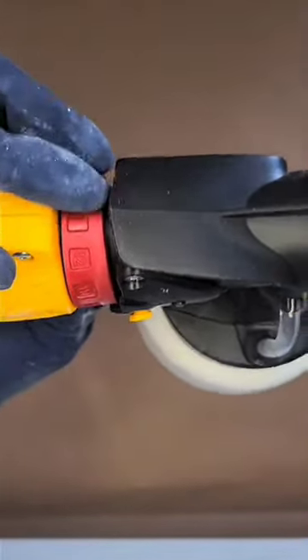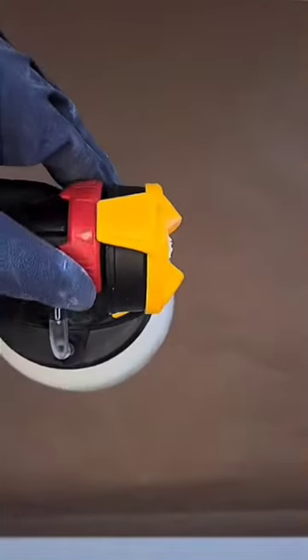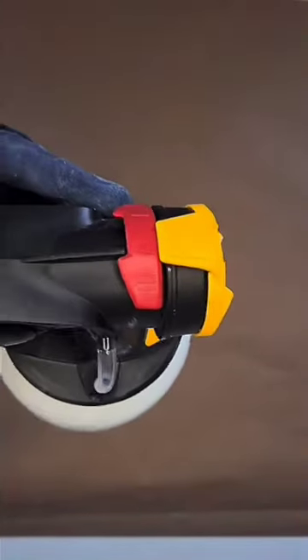Next, I'm going to attach the hose back to the gun, and I'm going to set the dial to 1. I'm also going to use a wide spray fan. Remember, I have the air turned all the way up, the material flow is at 1, and it's a wide spray fan.